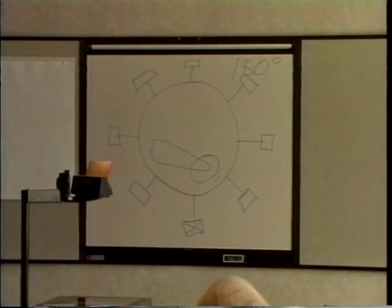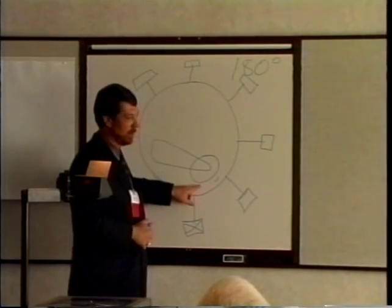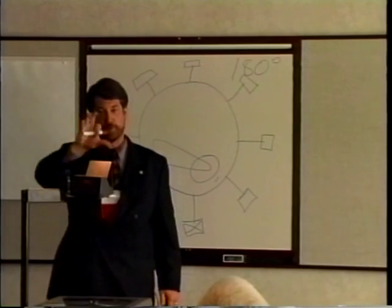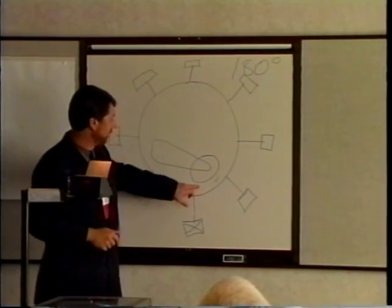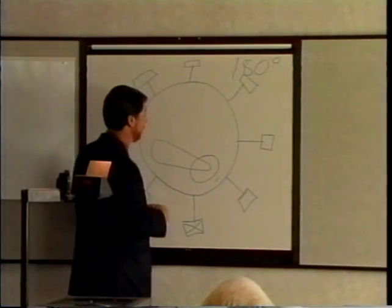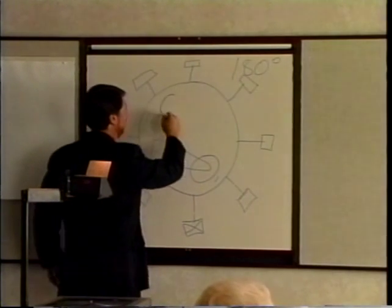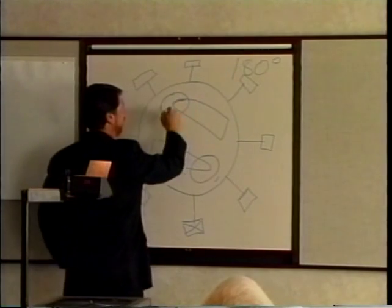A lot of people will put it back up into the position where you start and then take the weight off the bottom. You have to remember that when you timed it out, your crown was down here, so when you're in this position, it's just the direct opposite. Your balance wheel is up here. Your balance bridge is over here like this.